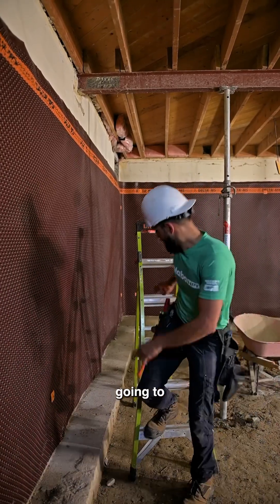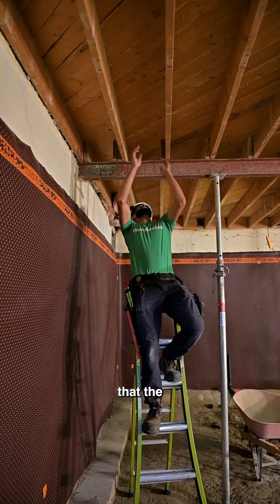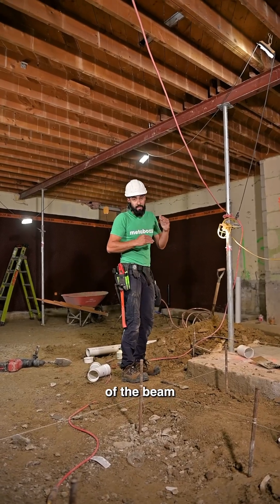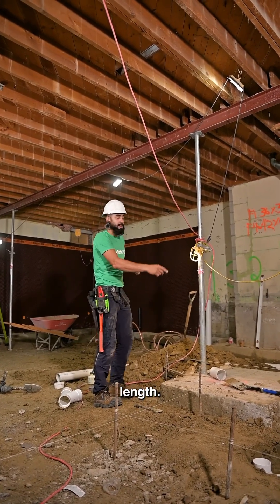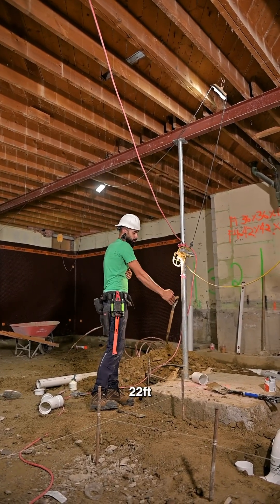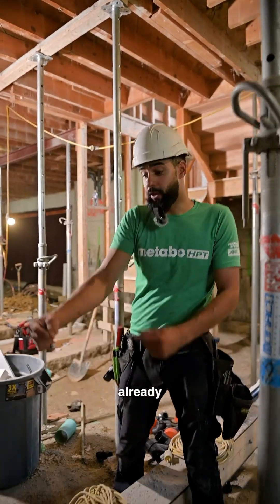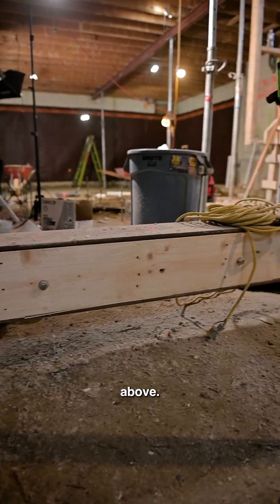Step one is always measurement. I need to measure each joist to make sure the bolts I'm using for the flush packing land in the voids and not where a joist hanger is. This has to be one continuous length - 28 feet, landing on two columns: 22 feet to the first and six to the second. Here's an example of a perpendicular beam I've already drilled out, showing the bolt holes located so they don't interfere with the joists above.